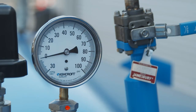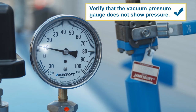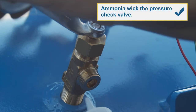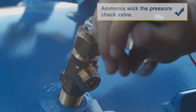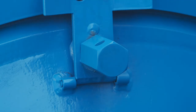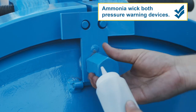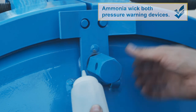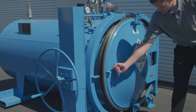The second check is the vacuum pressure gauge. If the gauge shows pressure, there is chlorine present and you must not open the door. Slightly open the pressure check valve and use an ammonia wick to ensure there is no chlorine inside the Clortainer. Close the pressure check valve after performing this check. The next checks involve the pressure warning devices on the door — loosen the top pressure warning device and check it with ammonia, then repeat this process with the bottom pressure warning device. After confirming that no chlorine is within the Clortainer, we can proceed with opening the door.